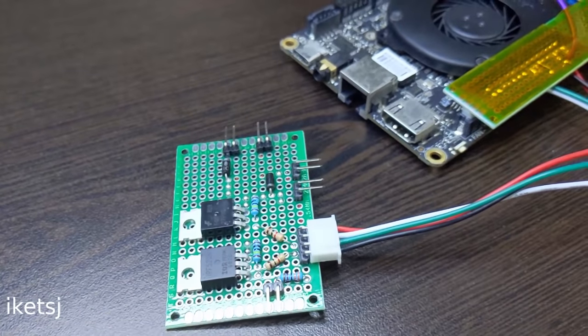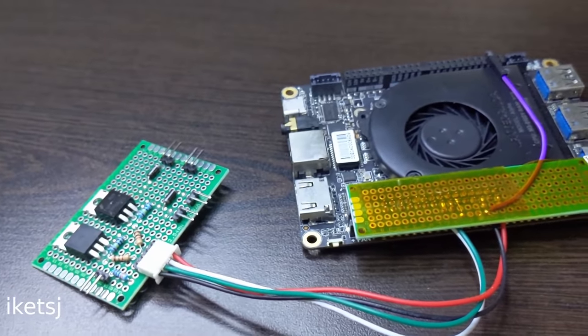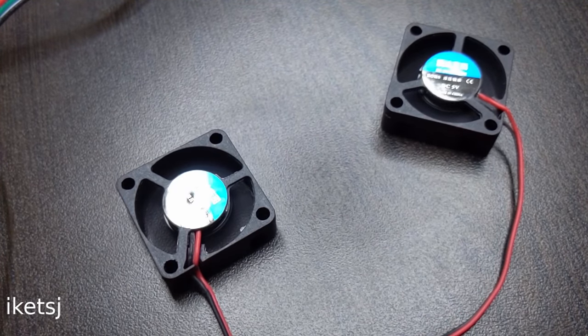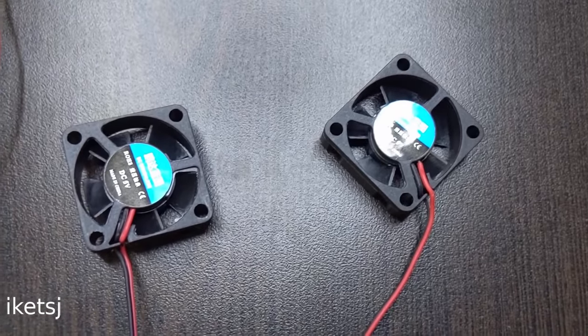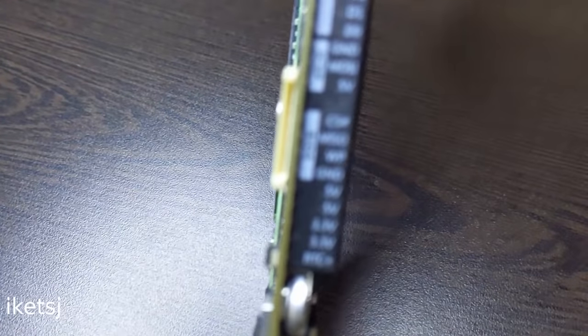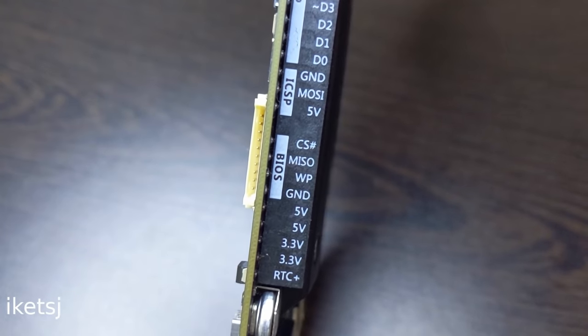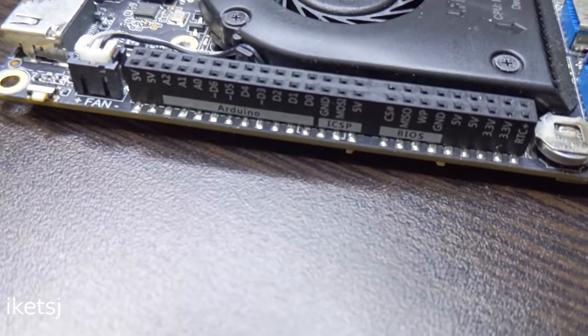Sure, we can maybe just remove the Arduino in the middle and let the S5 pin control those things directly. But we cannot control the speed of the fans if we do that. I have not yet implemented the feature of fan speed control anyway, but I'll just leave the implementation of it in the air. No pun intended. This would have been relatively easier if there was a circuit on the LattePanda Alpha itself to turn off the 5V power rail if it is powered off.